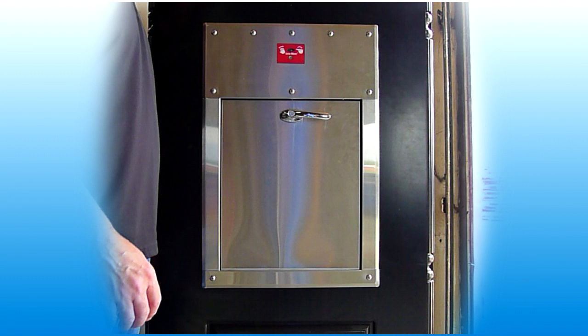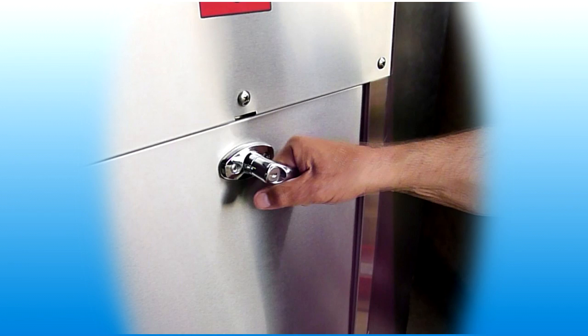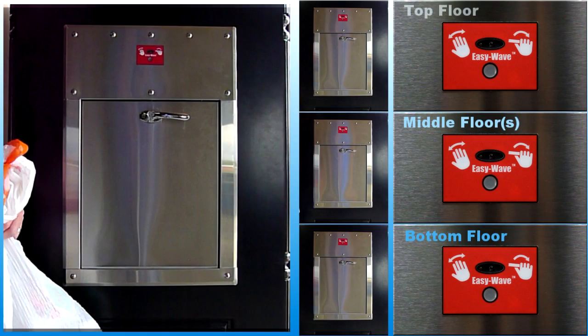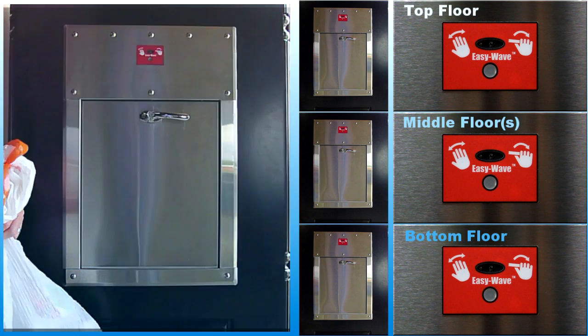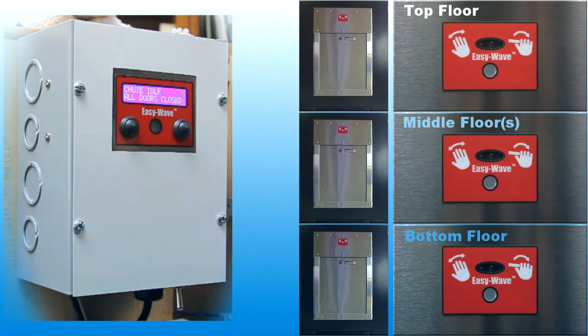At any time while attempting to open a door, if the indicator is red or turns red, the door will remain locked. Do not pull on the door or force it open in any manner. If a door is open on one level, the indicators will be red on all doors at the other levels. After the open door is closed, all the indicators will change to off. If the indicator remains red for longer than the normal open and close time frame, maintenance personnel may have locked out the intake doors. When service operations are complete, the chute intake doors will be re-enabled.